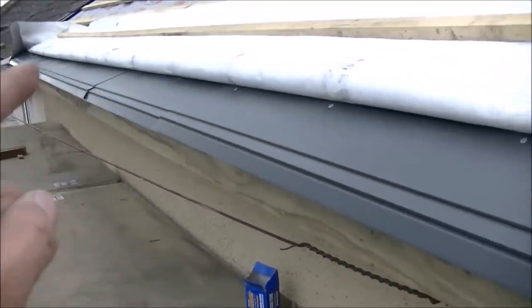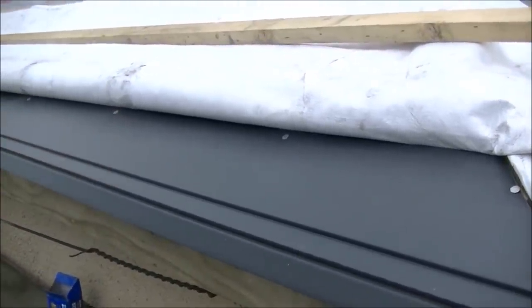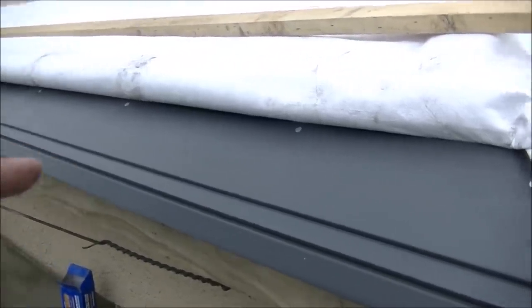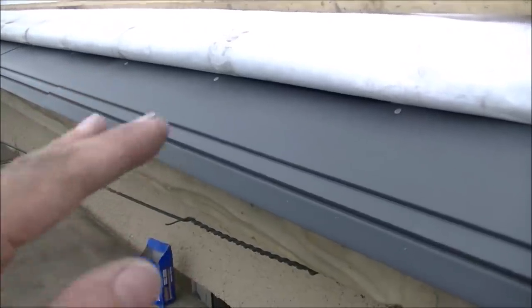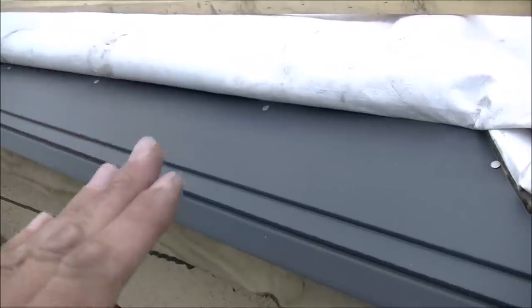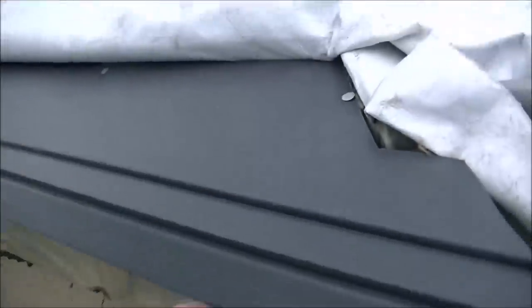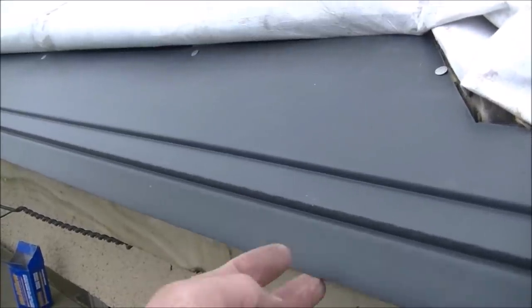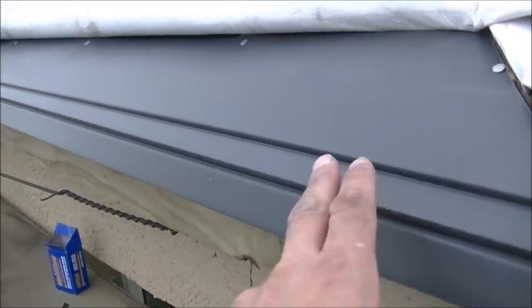If you look along there now we've fitted all the felt support trays. Earlier I mentioned leaving an overlap — rather than leaving 10cm I actually overlapped it up to the next rafter, so when I put a nail through it went through two overlapping felt support trays and down into the rafter. The nails are placed as high as possible because I didn't want to flex the plastic at all — if you put them too low it'll bend it down and be more obvious. Putting them at the top lets it hang freely. Once the gutter's on you won't see it anyway. You can just see all the fascia board underneath, and eventually once the UPVC and gutter are on, I'll trim the felt in line with the end of the felt support tray so there's no felt hanging in your gutter and rotting away. That's the idea — keep the felt up, and if it does rot a bit underneath it doesn't matter because you've got this to drain the water off.